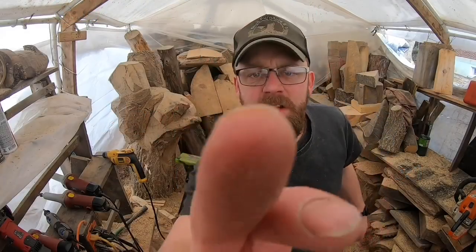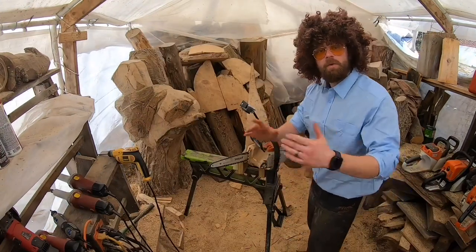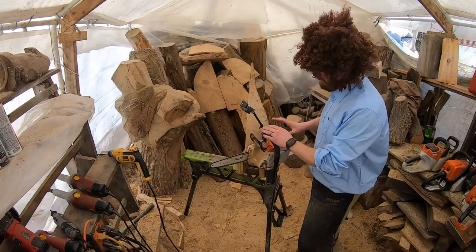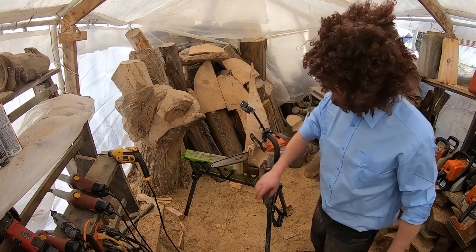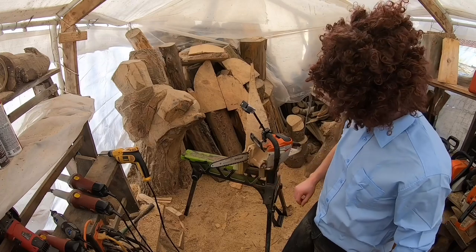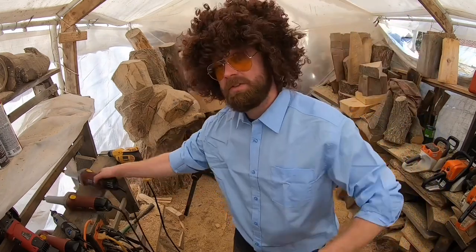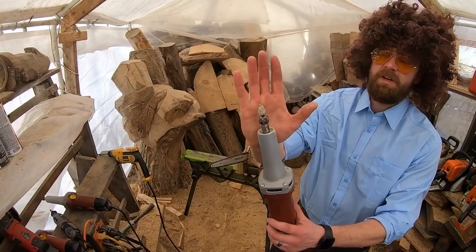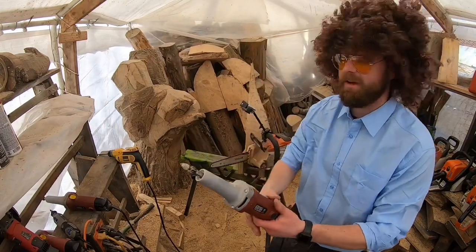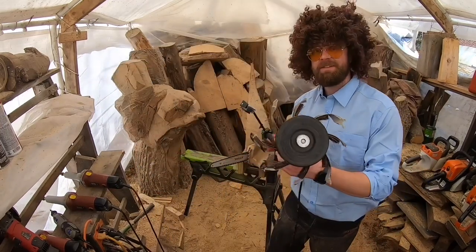All right, my friends, first thing we're gonna do is go over some quick tools. We're gonna be using a chainsaw today with a small bar, same kind of bar that's on your 170s and your 180s and your little 200 battery saws. We're also gonna be using a flame tip burr, quarter inch shaft, half inch green coarse burr right here in a die grinder. You guys are gonna need a torch and a Sandoflex flap sander.